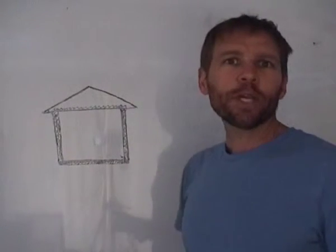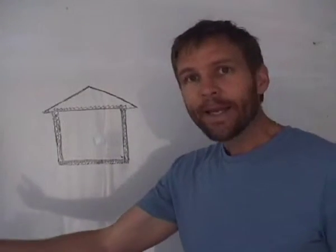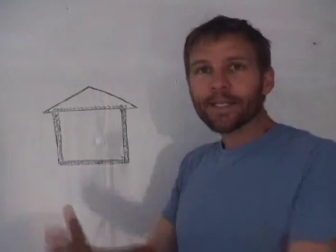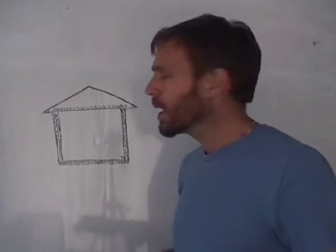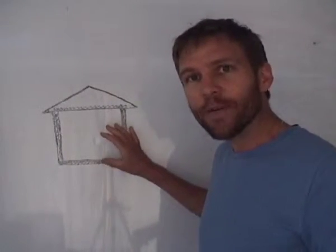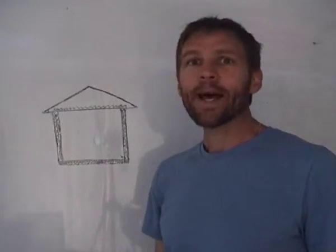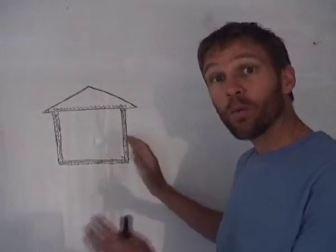It gets a little bit more tricky when we come to retrofit walls, because you have to either take the cladding off the outside or rip out the lining and stick some insulation in there, and probably have to put some building paper and stuff in there as well. So that gets a little bit tricky. The other challenge is connecting all that up, because in theory, having insulation in the ceiling, the floor and the walls, we would have a complete thermal envelope.